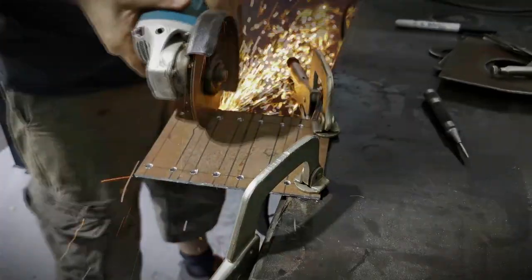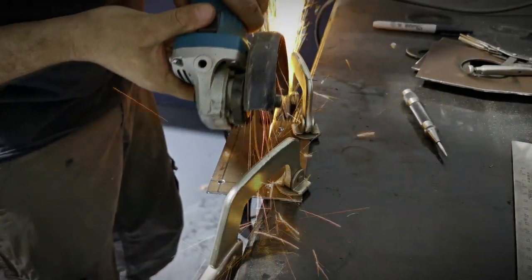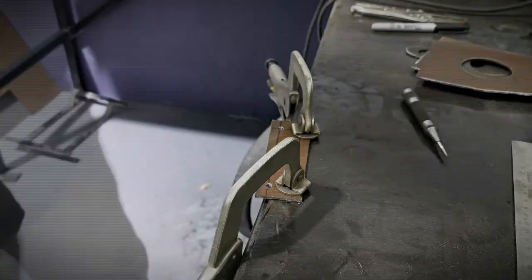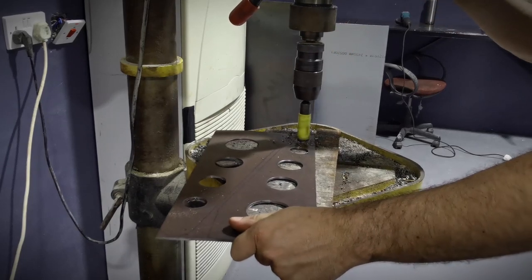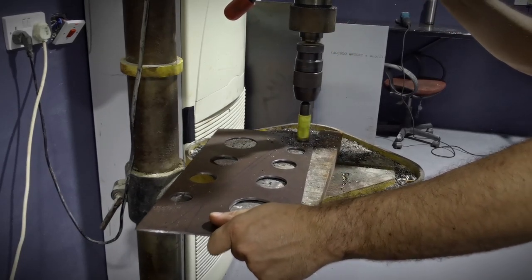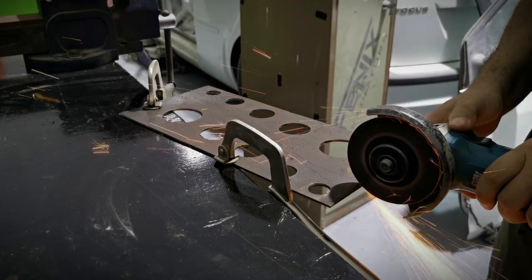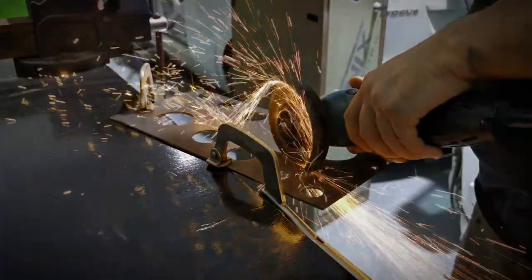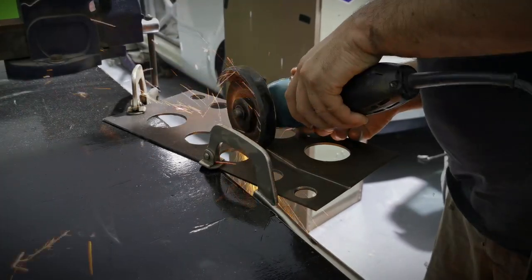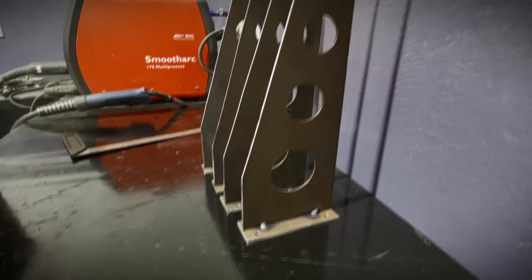We cut through the brackets like a knife through butter. For the brackets themselves I wanted an industrial look, and I already had a template from a previous project — mounting the triple screens on my sim rig. I whizzed out that template, it fitted perfectly, so those brackets got remade using that design. We quickly whizzed through them with the one-mil cutting disc, cut them down to shape, and tacked them together to form the skeleton of the industrial brackets.